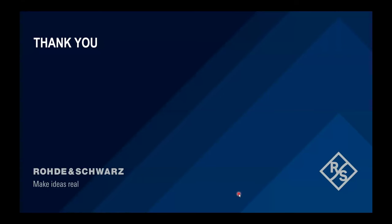So it's not that you're stating, okay, this is a fixed amount of time. It's the other way around. You'll have to ensure under all circumstances that your sequencing leads to a maximum current which does not exceed the capabilities of your source. And that's why this is not something I could answer with, it's always 10 microseconds. It strongly depends on your needs afterwards, and this has to be ensured in the cycling definition itself.